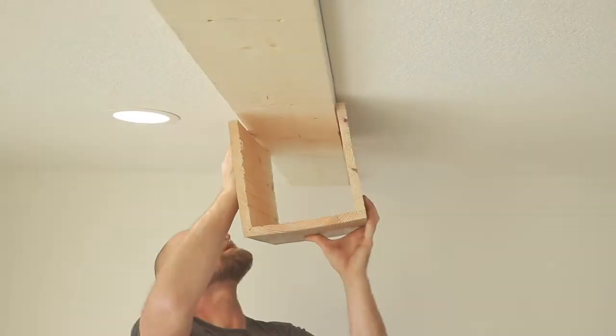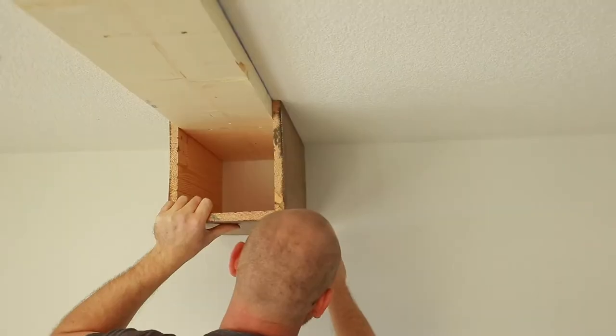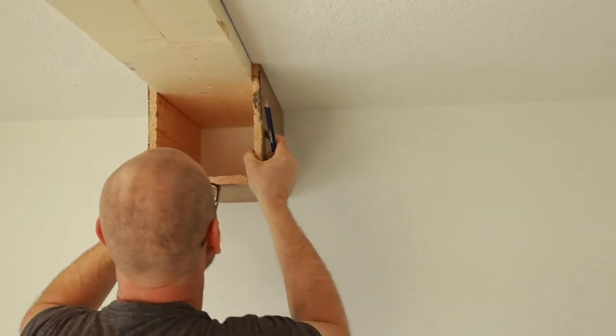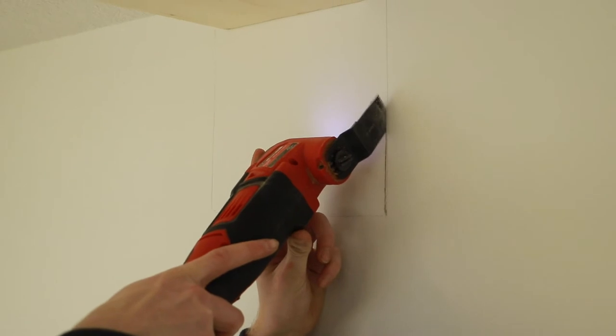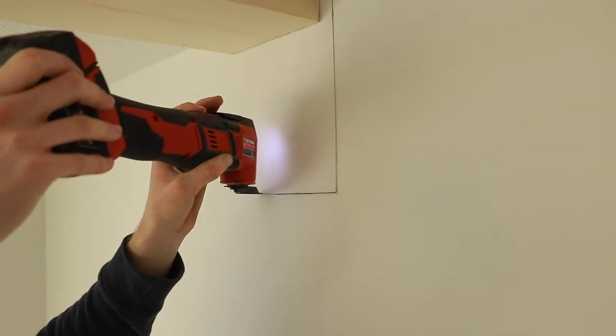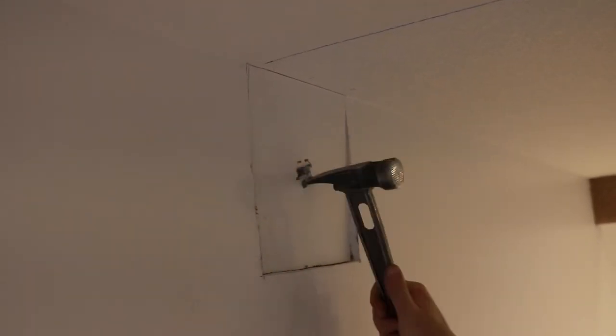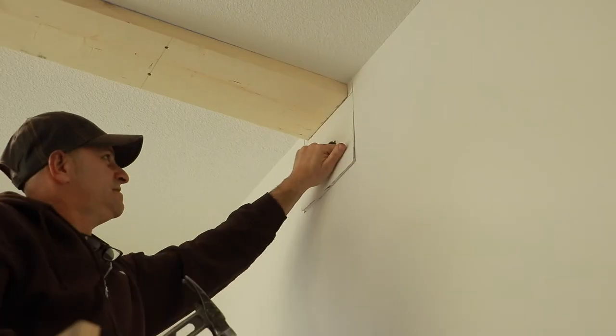For precise installation, remove the drywall on one end. Take a cut-off from the end of the beam you have cut, place it against the wall, ensuring it slides easily over the installed plate, and mark precisely where the drywall is to be removed. Then, using a sharp knife or a multi-tool, cut the drywall and remove as required. Box beams can be installed precisely against the wall with this method, or can be ordered with a small trim to ensure a precise finish.